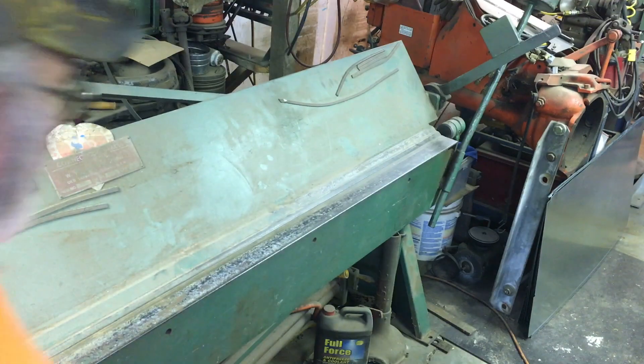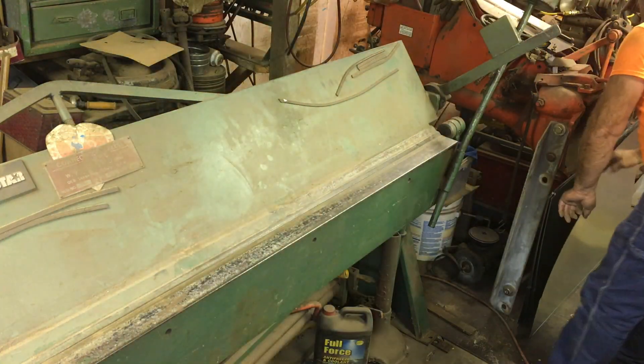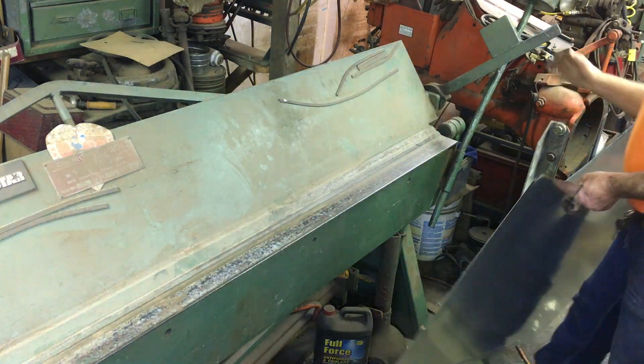That's pretty neat, but I haven't used that easy edger in about 25 years because it's definitely a little difficult, especially on close radiuses. You don't want to go less than an 8, 10, or 12-inch radius. On larger duct it's much easier to use because you can actually control and guide it around as the machine is eating it — and that machine eats it fast. Staying on that 3/16 mark accurately affects the quality and aesthetics of the fitting you're making.